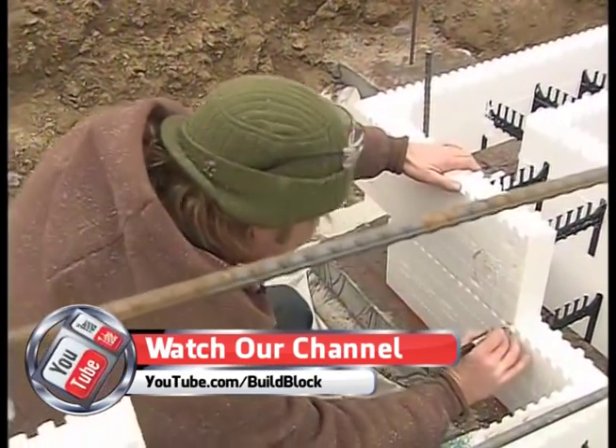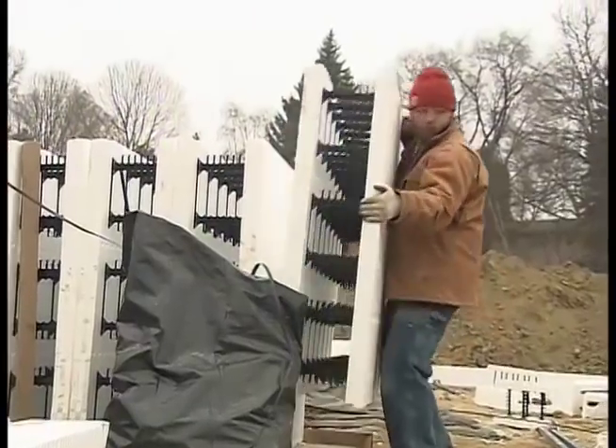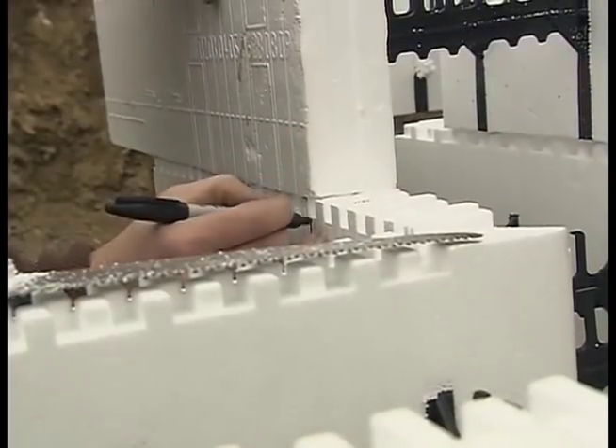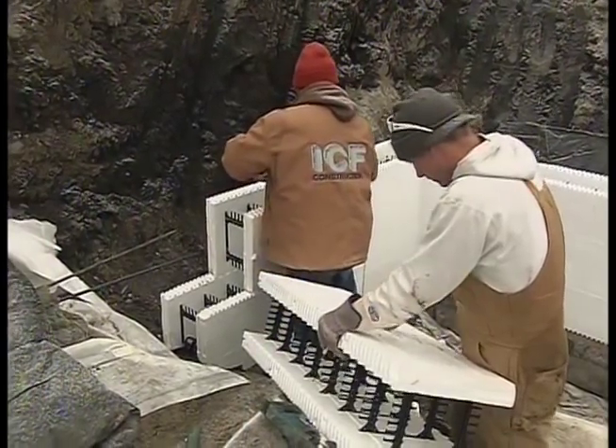That's right, they're considered fully reversible — top, bottom, left, right, back, and forward. They stack in and fit tightly no matter which way you place them. So what's the whole process for putting a wall together? After the footings are poured, you lay out your lines and literally start stacking the blocks, setting them in place, putting them together, doing any cuts as needed. We've got a fully gridded system on the side of them so it's easy to cut and do custom lengths.